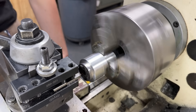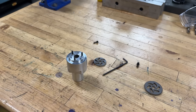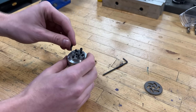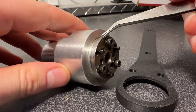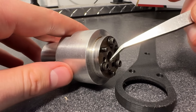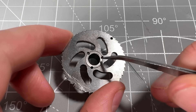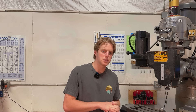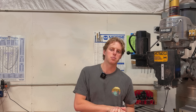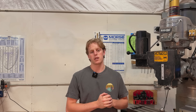This time I was going to make sure I got it right. I used pins to register the part through the main slots so I could transfer the setup between the lathe and the mill without any added error. The outer diameter needed to be just small enough to slide into the wrench handle, while the inner diameter needed to stay perfectly concentric to create a precise interference fit with the center bushing. By this point, I've remade every part at least once, many multiple times. The pins are dialed in, the teeth are all finished, and the plates are finally accurate.